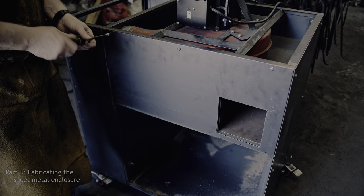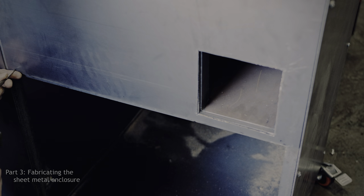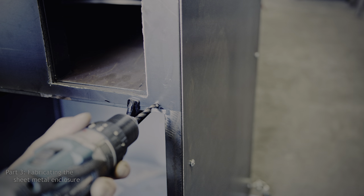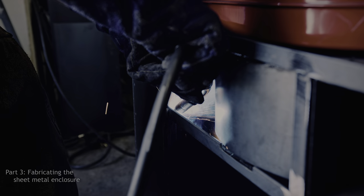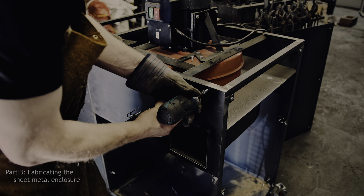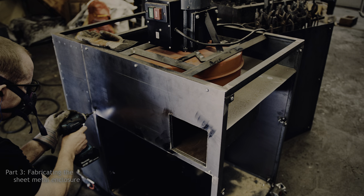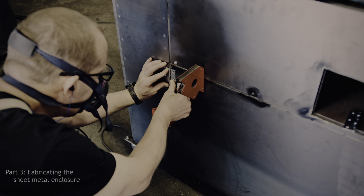Most of the work here is no longer on the dust collection mechanics but rather closing up the outside without too many air gaps. As I am making this up as I go, I attach most panels with screws so that they can be removed if I need to get back to the insides of the monster. I am still wondering what I should call it in the end — Frankenstein comes to mind, but that is a little bit long for a spray painted stencil. Instead of tapping the holes, I just tack weld a nut on the inside which is fast and sufficient. Now that the upper part of the front panel is attached, I have to figure out the door. The hinges should be fairly easy to attach.